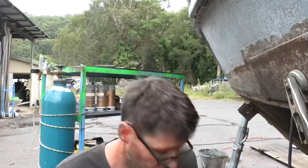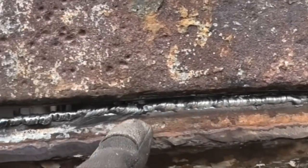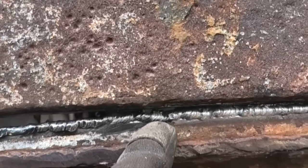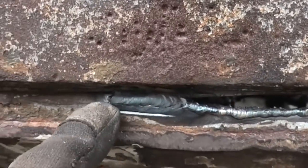The weld's getting pretty ugly because it's contaminated by internal paint — should have thought of that. So I'm going to duck inside and grind that off as well. I started here and it was a little bit cold because this is actually relatively thick metal. Got to here, possibly a bit hot because we were getting to that sharp edge. Then we started getting the paint contamination from the inside, and then things started going pretty smoothly again by the time I'd ground everything off.